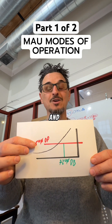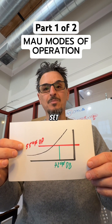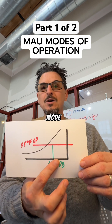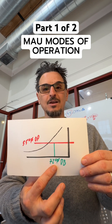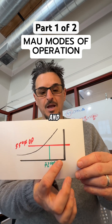So anything above your dew point set point, you will be in dehumidification mode. You'll be cooling and drying out the air and reheating the air at the same time. If you're below the dew point set point, you will be either in heating or cooling mode. If our dry bulb set point is 72 degrees for your supply air and you're below the 55 degree dew point...